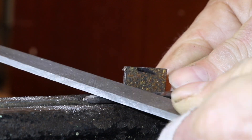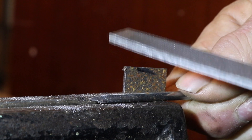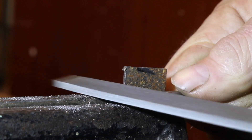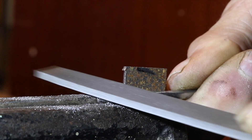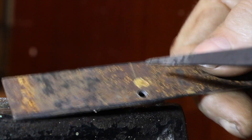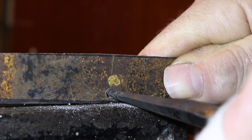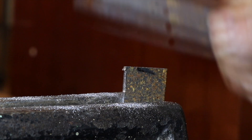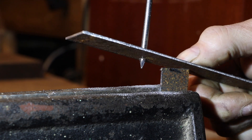The process of fitting the pin is really just a matter of filing a little bit, testing it in the hole, making any corrections necessary until the full length of the pin is locked into the hole. I first found out about this years ago but never really tried it because I was always a little intimidated — I thought the precision needed would have to be astronomical, but I'm here to tell you it really doesn't, certainly not for thin stock. For fixing holes in sheet metal or even up to one-eighth inch plate, you just file the end evenly to create a taper and see where you go from there.